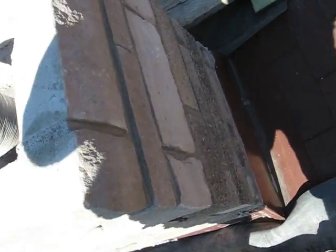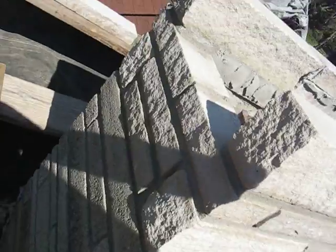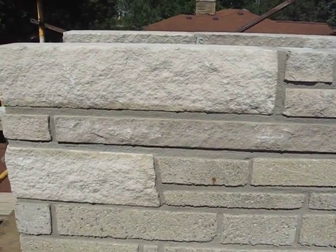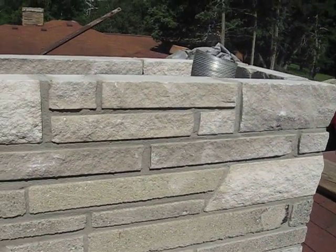I do a lot of those. This one here, the flashing's in real good shape. The roofers actually did a pretty good job on all the metal work. So we're just going to re-glue all this stuff after the chimney's up. This right here is a pretty different material. We laid this out of most of the old material, the stuff that was good. Can't buy this anymore. It was made somewhere around the 1960s. So what we do is we take a cut limestone, cut it into this chimney to do our initial top out.